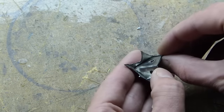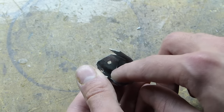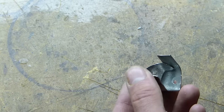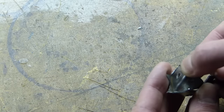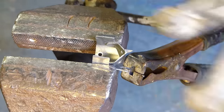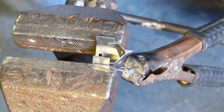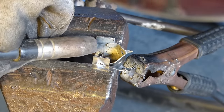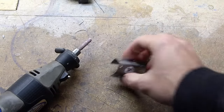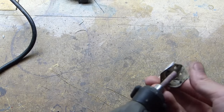So we're just going to fit these together. I'm going to get out a welder and weld just a couple of spots there, and then one spot up inside here somewhere. If you don't want to weld it, you could also possibly solder it or maybe drill a hole in the side and rivet it through there — but if you just rivet it, I'm not sure how you're going to keep it from being able to pivot. I've got these two pieces sitting together in the vise here, so I'm just going to weld a couple of tack welds and let it cool off for a little while. After you've done the welding, you're going to want to come back with a dremel tool or some other little rotary tool and grind out the excess of the weld so it's more smooth inside.